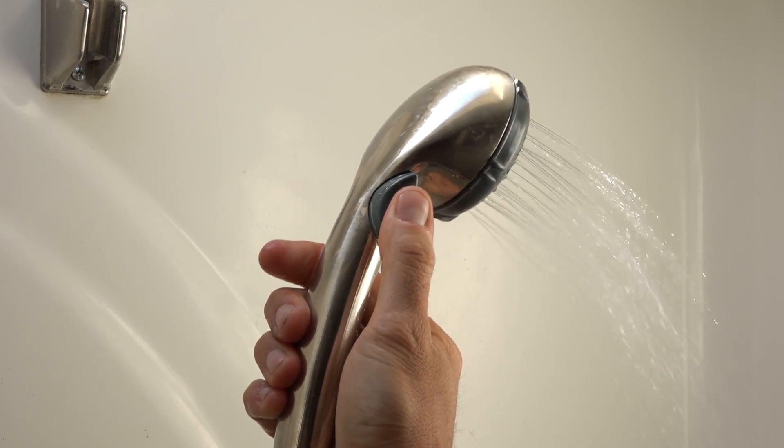One of the greatest things we realized with the Truma is that in the shower when we're off-grid, we have the water shut off when conserving water. When you use that water shutoff valve on the handle to quickly shut off the water, with our previous water heater — and in other RVs we've used as well — we noticed the water would get ice cold when you turn it back on. We think that's because there is a pressure drop in standard tank style water heaters and the water actually flows back into the cold line a little bit. With this water heater, that does not happen anymore. No more ice cold blast when you turn the water back on.